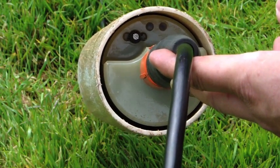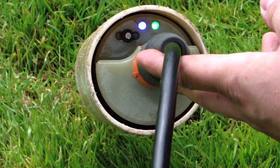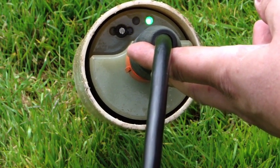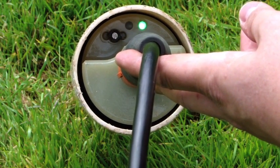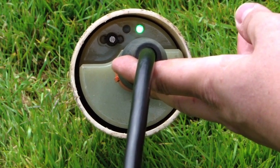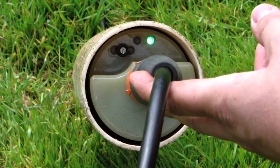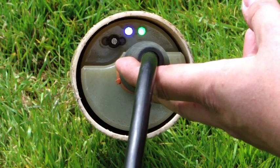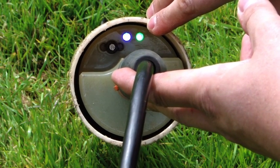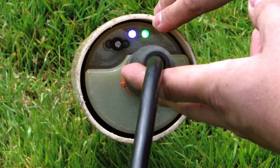The transmitter has a single power switch on the back. You twist it to turn it on, and there are two status lights. The blue light flashes quickly while the transmitter is turning on, and the green light is on solid — the green light simply indicates power. Once the transmitter is through its turn-on phase, the blue light will start flashing a three-digit binary code. A short flash represents zero and a long flash represents one. So if we're looking at the light flashing right now: short, long, short — that's zero, one, zero.